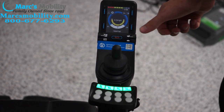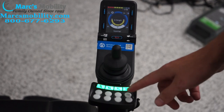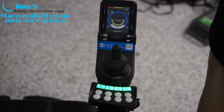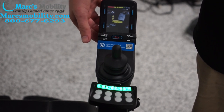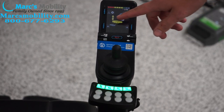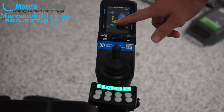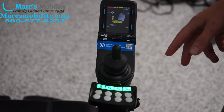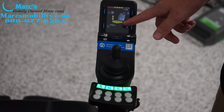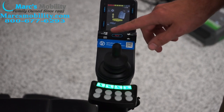All the lights work the exact same on this profile. Now, what if we want to use the functions in the chair? We could use a switch box, but not every chair comes equipped with that, so we can operate the functions through the joystick. I flip up again to change profiles — now we're in our function menu. You can see a picture of the chair with a portion highlighted in yellow; whatever is highlighted is the function we're going to use. This chair has seat lift, tilt, recline, and legs — it is fully loaded. Right now the seat is highlighted, which would be seat lift. To engage it, I would push the joystick either forward or backwards.